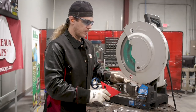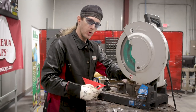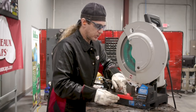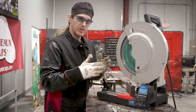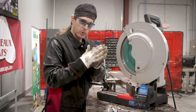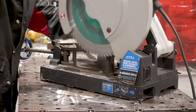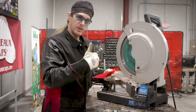Always a good tip: whatever miter saw you have, always go ahead and square it up. Sometimes if you go by the reading where it says 45 degrees or whatever, it's always a good reason to double-check it. If it's out a degree or so and you start putting stuff together, things are going to get wobbly. If you're looking for really precise cuts, make sure you square it on the outer as well as the inner — bring your saw down and check it for whatever degree you're going with.